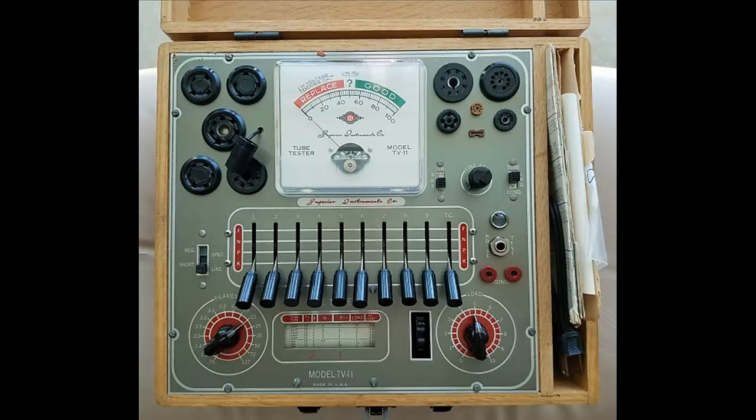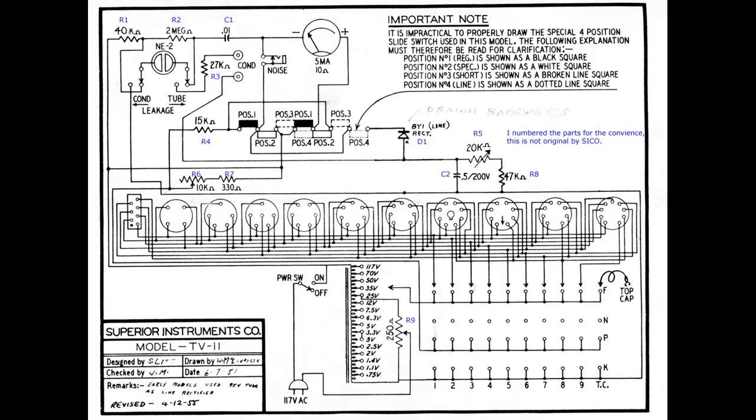And that comes in handy if you have a pin, like there's some tubes that say pin 2 and 5 may both be connected to the same internal element. Well, it lets you have just the one side being tested and the other side hanging in the air, so you're not grounding both sides of it, maybe getting an extra reading that you don't want. But otherwise, it's the same thing. You get your filament voltages, your load setting, and it's just the same thing as the Knight.